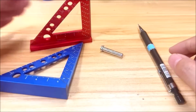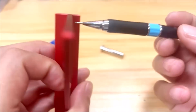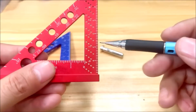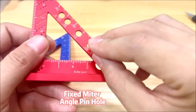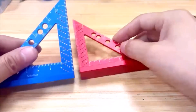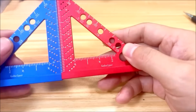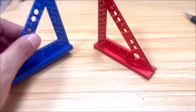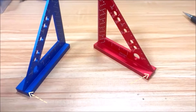The small square tool with a 0.7 millimeter mechanical pencil is a precision woodworking tool that offers accurate measuring and marking. With its perfect design and high-quality construction, it is ideal for carpentry, furniture making, and cabinet making. The tool features parallel scribe holes, a peephole for center drilling, and an offset base for precise marking. It can set table saws and router table saw guides to 90 degrees and 45 degrees. Made from durable aluminum alloy, the tool is rust proof and corrosion resistant. With its compact size, it easily fits in your pocket, and the laser printed imperial scales ensure clear and accurate measurements.